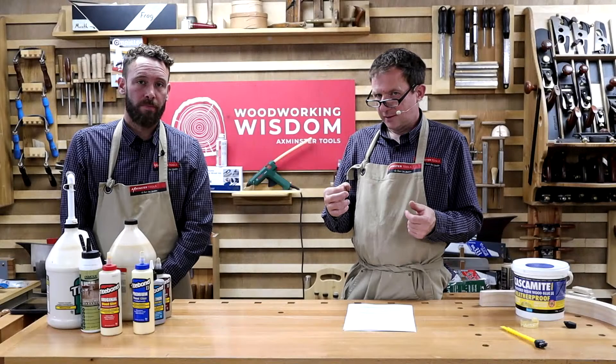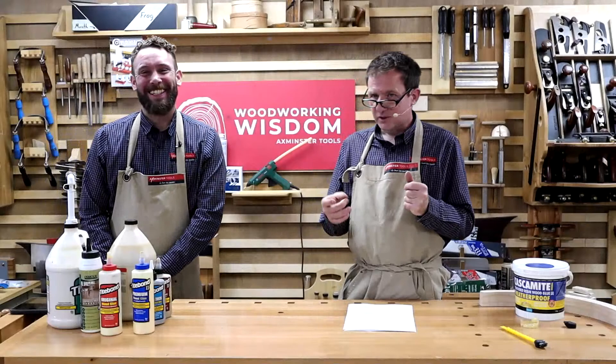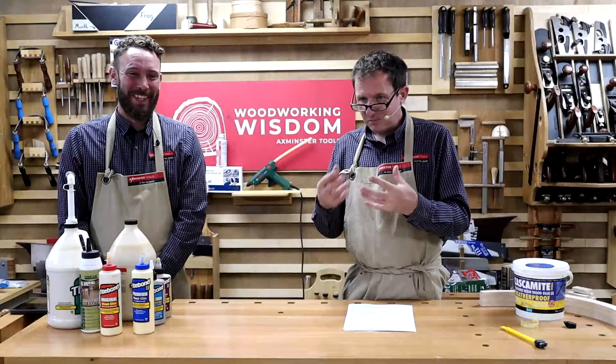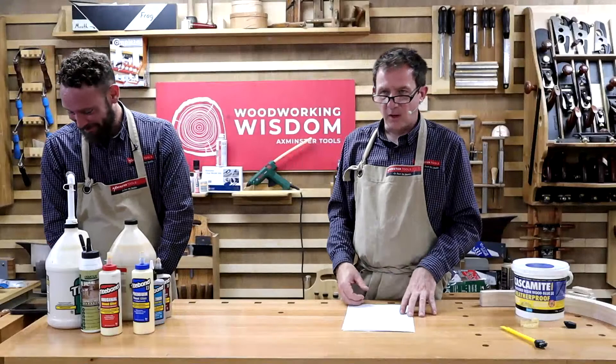Is it toxic? Is there a vapour? We've got a glue that really smells when you squeeze the bottle. Does it give off fumes? With superglue, if you've ever put it on something wet, you can get fumes — really stinging for the eyes. I've done superglue on lathe work wearing my respirator hood so the fumes can't get through. Things like that can really play a part in what you're using.